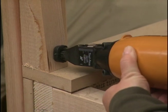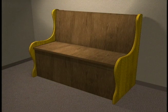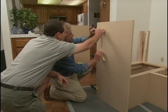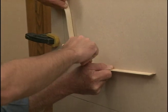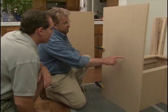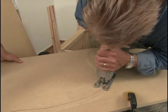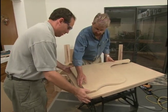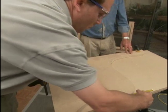Watch your fingers. We've decided to create curved end panels for our bench, so I've soaked narrow strips of wood in water to make them very flexible. As I bend the strips into the curved shapes we want, Craig traces their outline with a pencil. Then we use a jigsaw to cut the pattern out, and the first end panel serves as the template for the second.